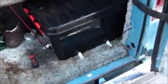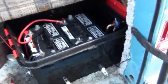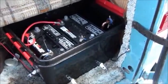The other battery bank — battery bank two — is a little different. I didn't feel like buying more expensive batteries, so I've got less expensive wet cell batteries. The only problem is that since they're going to be hooked up to solar all the time, there's a potential for venting hydrogen while charging when the sun's out. Obviously at night, when the system goes into sleep mode, it's not likely to vent hydrogen.